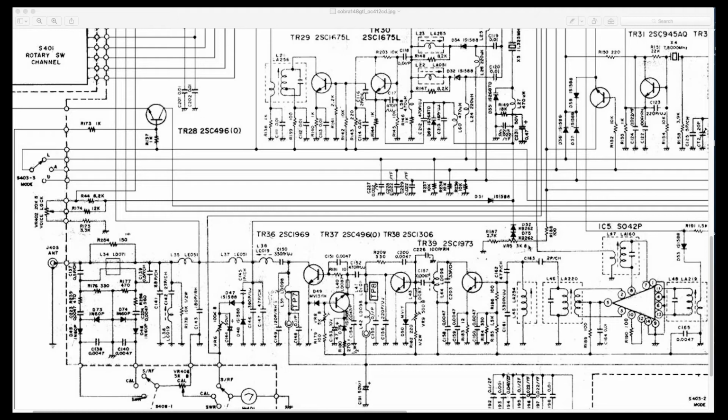It's back to standard, and so I thought I'd show you where on the circuit diagram these parts are. So why they did so many changes in order to do that modification, I don't know. To be honest, it doesn't make a lot of sense. All they had to take out was the 75 and take off this wire, this 8-volt feed from that side. It's only an 8-volt feed, and going to a constant 8-volt feed would have probably been enough. But anyway, that's what they did, so it's fine.